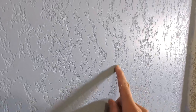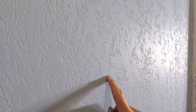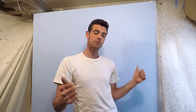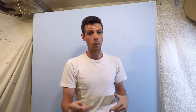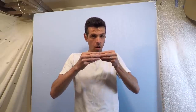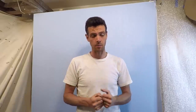What that ended up doing was making the flat parts too big, and there's not quite enough definition in the areas between the flat spots. The only part that worked out was where I did the nail pops — the rest of the wall was primed and this was bare drywall mud. So that taught me: I need to spray with more definition between the flat spots, and I need to wait a little longer before wiping it down, because wiping too soon flattens it all out and you don't get those nice little knockdown spots.